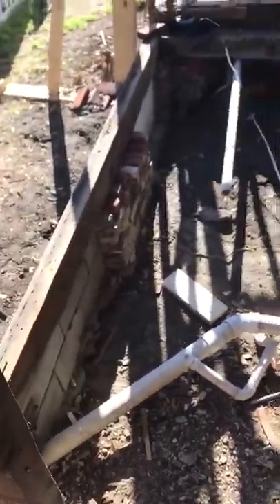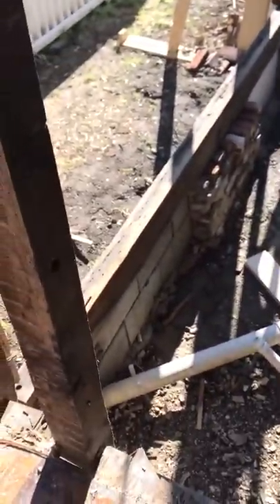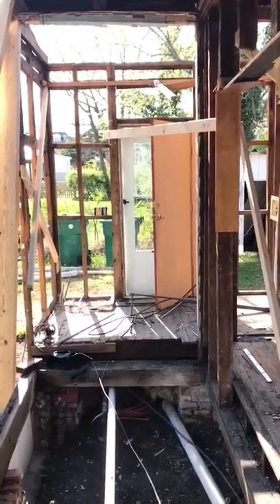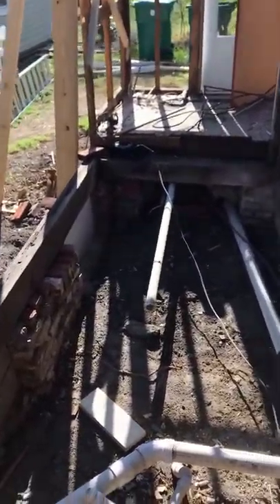The entire right side of the duplex is going to be exactly the same. Downstairs is pretty much what I showed you last time — we haven't laid the floorboards out yet. Now, this might scare you a little bit: this part of the house is rotten, which is ironic because the same area was rotten on the pink house too. Apparently all these houses that had a side porch that was later enclosed were not done perfectly, to code, or watertight. We have to reframe this side — it's something we knew pretty early on — so it doesn't really scare us.